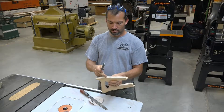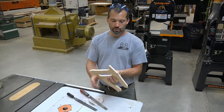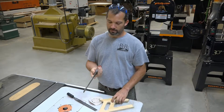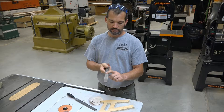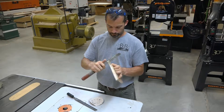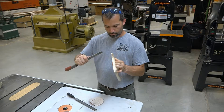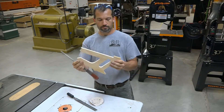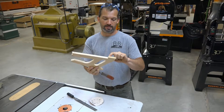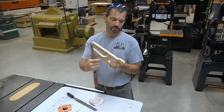That didn't take very long, and you can barely see the burn mark anymore. I'll finish it off with sandpaper when I get there. When I get to a corner like this, I've got a little bit of an indent, so I'm going to use my file that's got a surface on both the edge and the flat, so I can clean that at the same time. If you went too deep past your line, sometimes it's best to go back to the bandsaw and cut a little off to try and catch up with your mark.